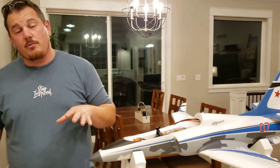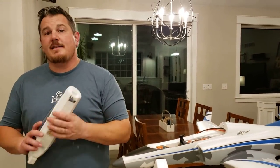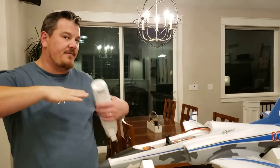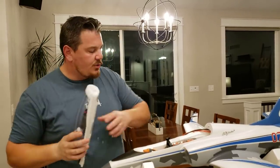So here's how we're going to resolve the button pressing issue. Okay, first of all, we're going to take some hot glue. We're going to do 2 drips or maybe 4. And we're going to just put drips on the perimeter of that button so that the battery can never actually depress down onto it, because the battery is a flat plane and therefore it can't squish down on it.